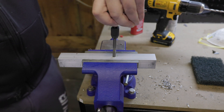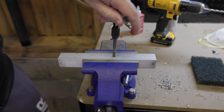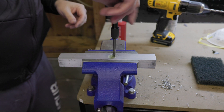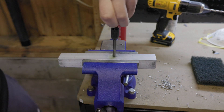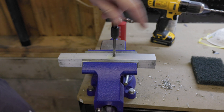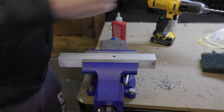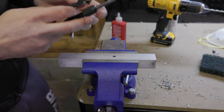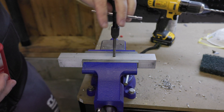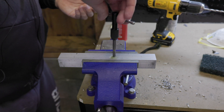What I like to do is go until it gets a little rough, then turn back a quarter turn. You go forward a little bit, you get chips built up, then you go back a little bit, go forward, and add a little bit more oil. Then go back to break up the chips and continue this process throughout. Every once in a while I like to take it out and just clean up the tap — you can see all the metal chips and shavings. A brass brush does well cleaning it. Brush it into the hole, then put it back in place, and you'll notice it's mostly threaded from where you were before and you can just continue on.